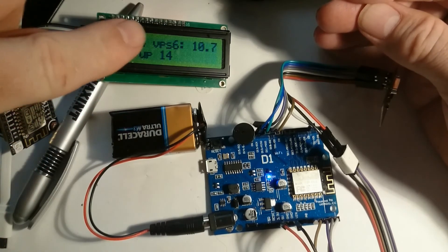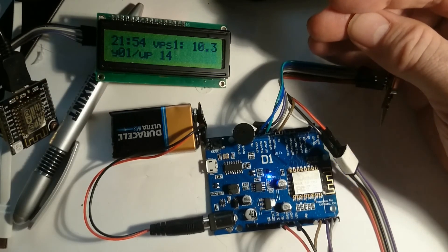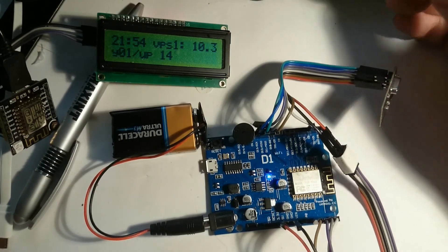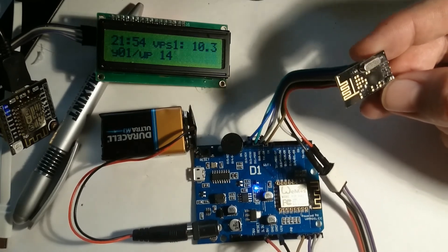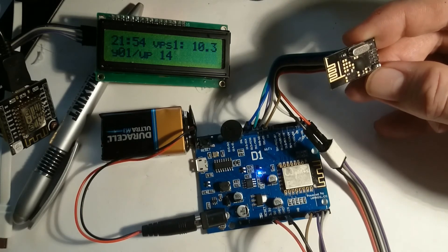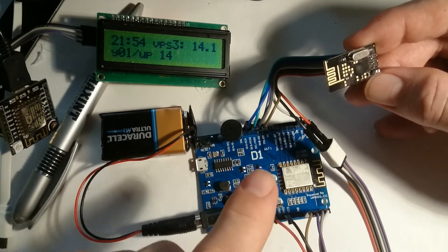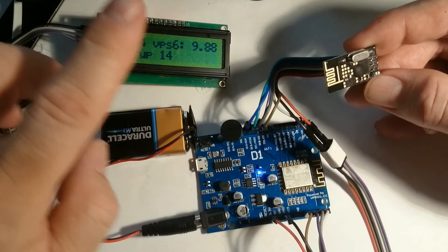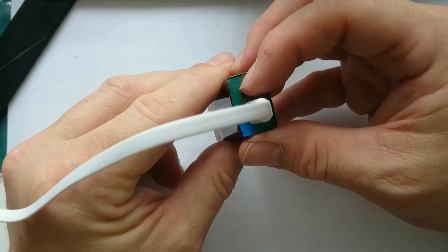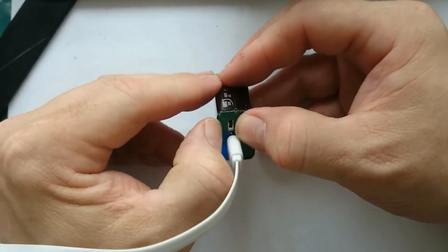On this display you can see some other messages from my VPSs that are still running, and the MQTT broker Mosquitto is running on a Raspberry Pi that you don't see in this image. The idea is that when a battery-operated node sends a message through the NRF, this gateway will then translate it into an MQTT message that can be handled by the rest of the network. Hope you liked this demo — thank you for watching, and you can subscribe to be notified of any future videos.